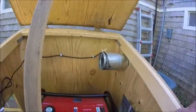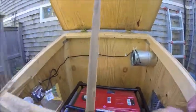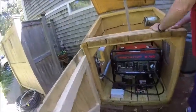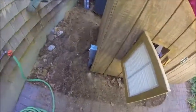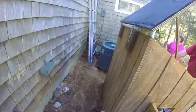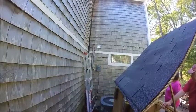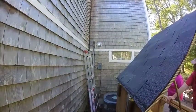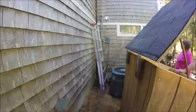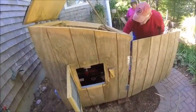We have the fan going. We step around here and we've got to put the covers on the LBs. But we ran it up — inch and a quarter is a little bit overkill, but it was a hell of a lot easier than going through one inch pulling that wire.